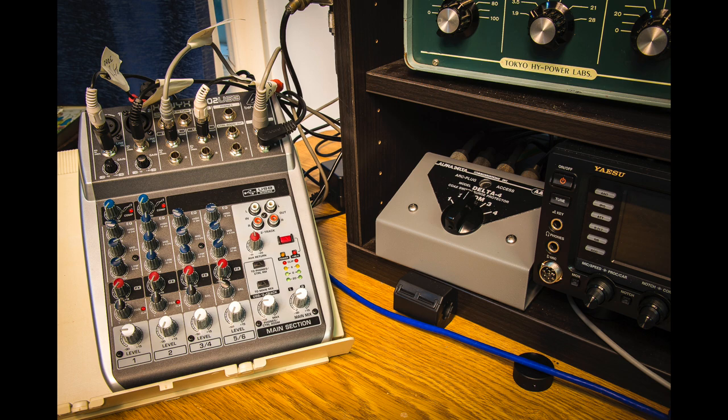Here is the mixer installed back into the system, with rather large clumsy-looking tags on the leads at the top there, telling me which radio is plugged into each channel. I like to have the mixer sitting on a book reading stand so that it is tilted towards me. The way I use it is I have the volume controls on each radio set to about mid-volume and generally leave them set there. My left hand is adjusting the volume for each individual radio with its respective level control and the main mix fader control. Once I've set the volume controls on the radios, I tend to leave those and just purely work from the volume controls on the mixer.